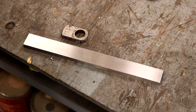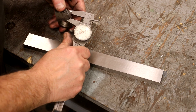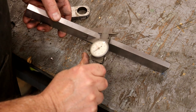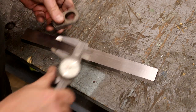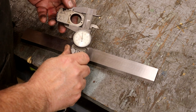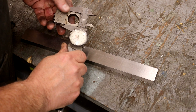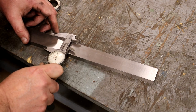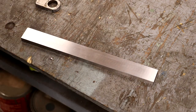There we go — there's our finished piece, all nice and ground to size. Let's double check our work. Thickness of the original was 435 roughly — and we got 435 right there, the same thing within a thou. And our width in this direction — this is a rough dimension, just a rough casting, so it varies — but about 1 inch 275. And we're right in that same ballpark here. That looks good. Finish is great — nice ground finish just like the original.